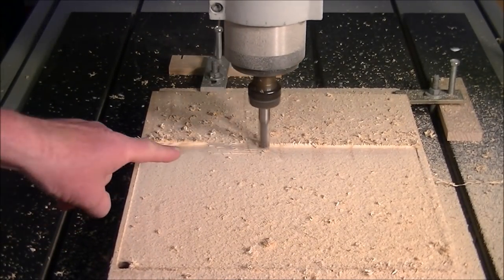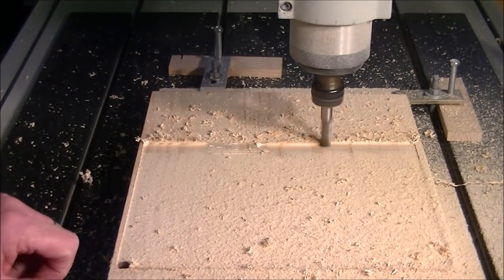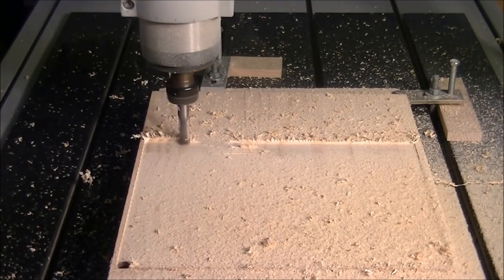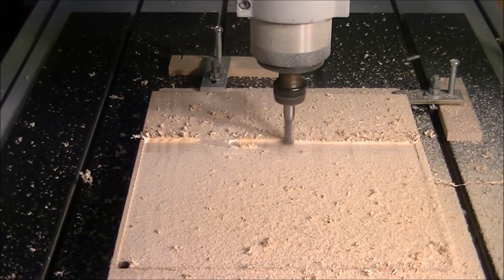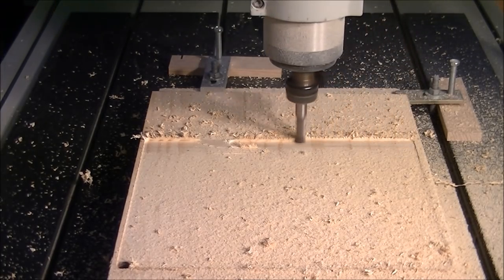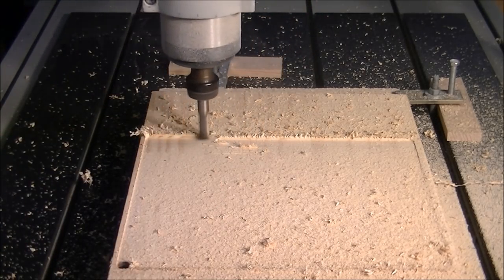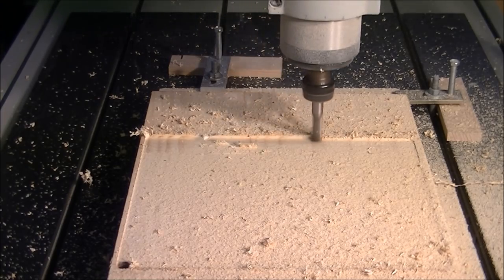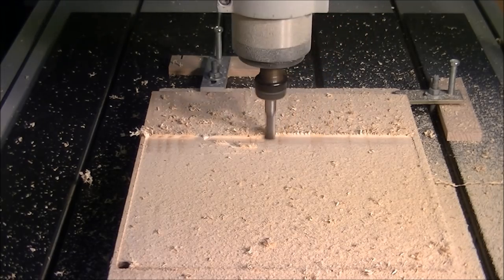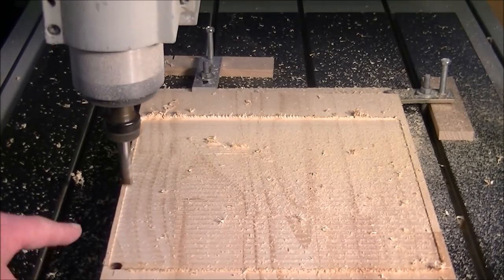You'll now see what I was explaining, that as the tool approaches this area here, the slowdown. See, you saw it there. Just momentarily, while the Z picks up and it allows the X to go further over, then drops down. There's just a momentary pause. Or should I say, not a pause, but a slow down, very slightly slow down. So it's now coming over the second cut.